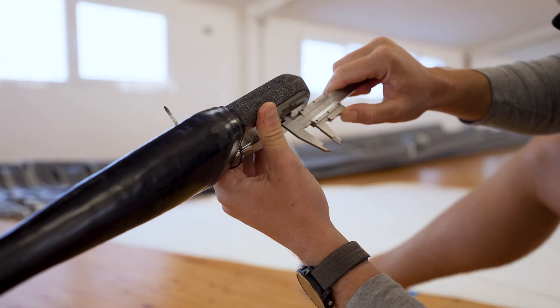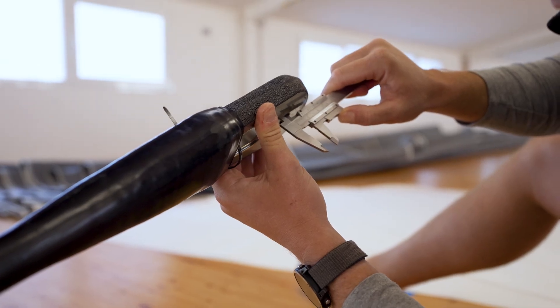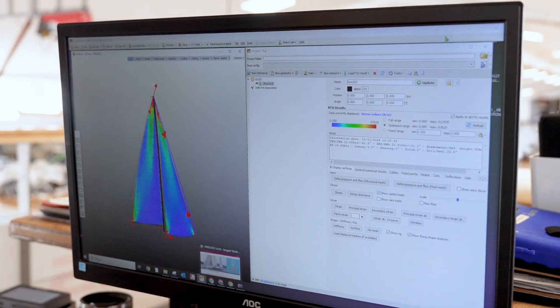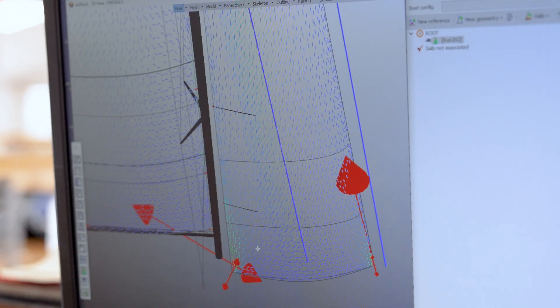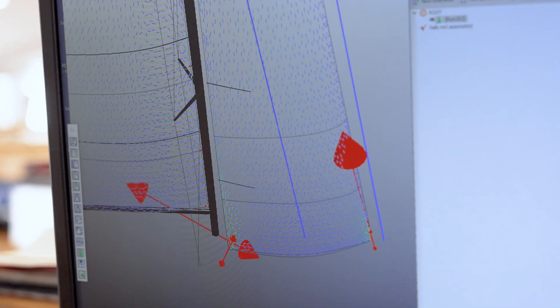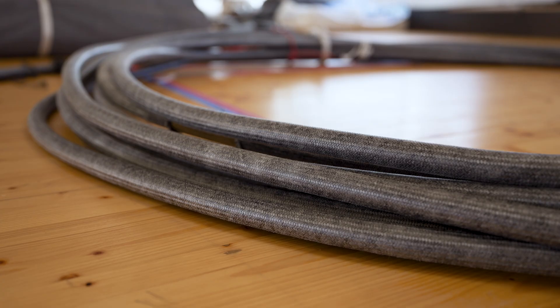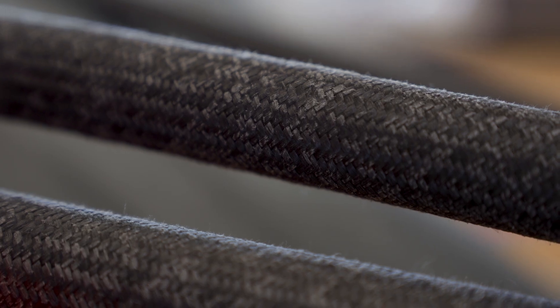When designing or ordering a new cable, we work with our partners Armare on this one. We have our CFD studies so we know the loads on the sails — the computer modelling tells us the loads. We pass this information to Armare and they do their own calculations, so we ask for a specific working load and they figure out how much material they need to use. We had no option of reusing the old cable because it was slightly damaged and quite old, and we don't want any problems since you want the cable to be as strong as it should be.